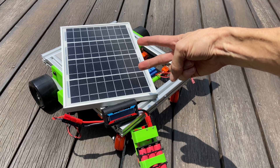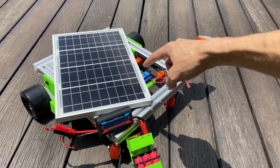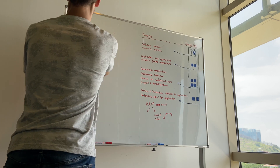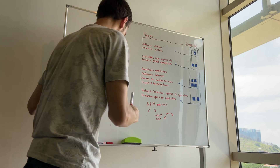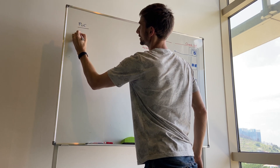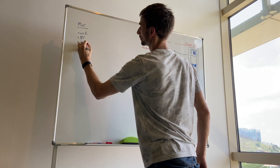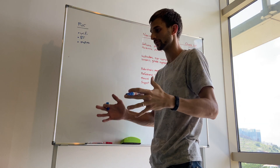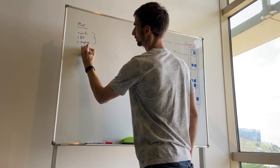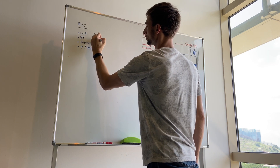That's while running Bluetooth and Wi-Fi and driving the motors and, of course, running Python programs on the microcomputer. So previously we checked the power consumption of the whole robot. The power budget is going to have Wi-Fi, Bluetooth sometimes if you're using the gamepad, motors — and this is cruising around, not carrying a payload in this previous test — and, of course, the Raspberry Pi or BeagleBone microcomputer. All of this is 7 watts, and that's pretty reliable as a figure.